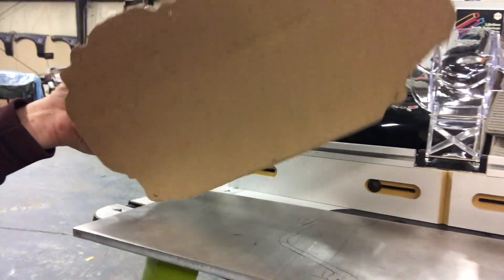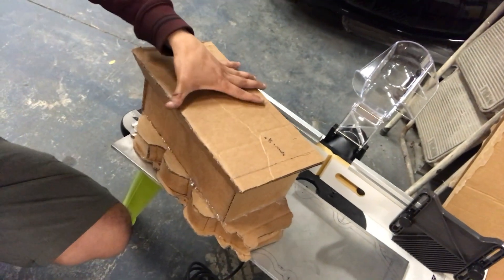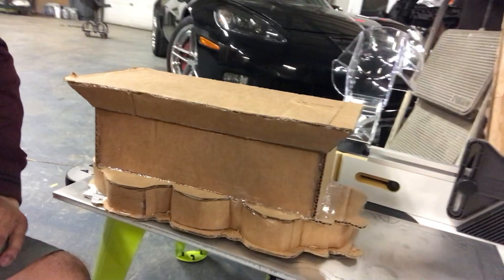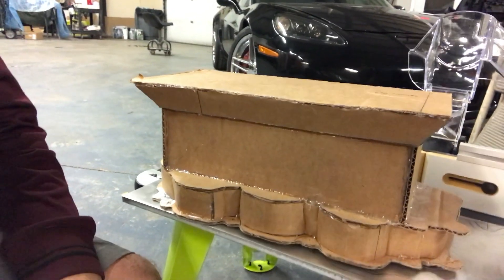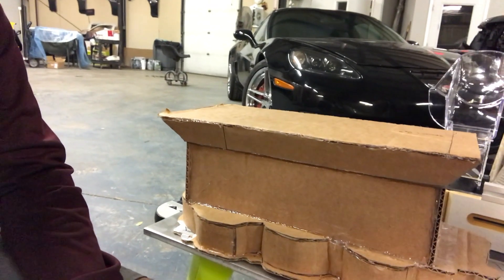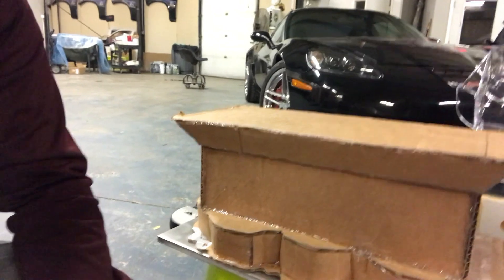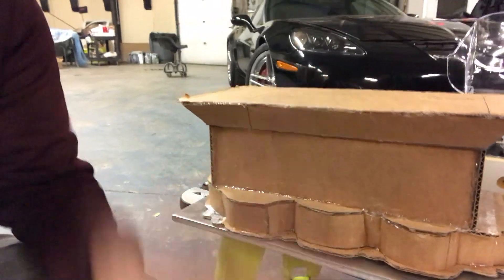This is what I mocked up. The bottom shape here is the lower manifold that's on the car — I measured all that and cut it out. This brick in the middle is basically the intercooler core that's coming tomorrow. Tonight we need to make this spacer section to lift off the deck of the manifold, get some clearance off the polished runners, and actually increase the plenum volume slightly inside the intake so it will hold more boost.